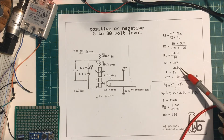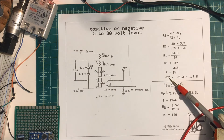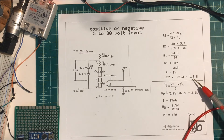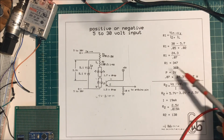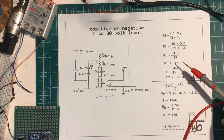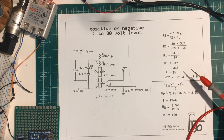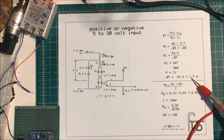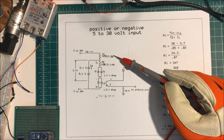Now they make a 360 ohm resistor. For 360 ohms, 70 milliamps times 24 volts is 1.7 watts to dissipate, so I need a 2 watt resistor. I didn't have a 2 watt in 360 ohm, but I did have a 470 ohm 2 watt resistor. The 470 will reduce the current to about 50 milliamps, and the wattage I'll dissipate is only going to be about one and a quarter watts. So a 470 ohm 2 watt resistor will be just fine.